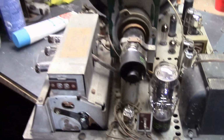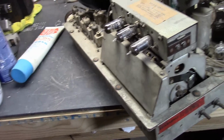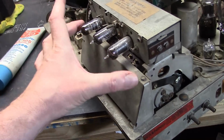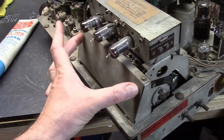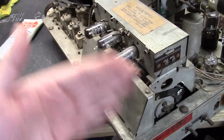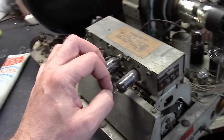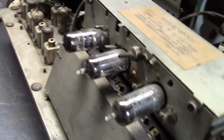Yikes. What else? This comically large tuner. I think there's a nickname for it, like a Ferris wheel tuner or something like that. There is a huge Bakelite plate here for each channel, about that wide, this long, that has various coils and caps to form a bandpass filter and have the local oscillator component values for each channel. And this will be your typical trio of tubes, which would be an RF amp, local oscillator, mixer. That's it, I guess.